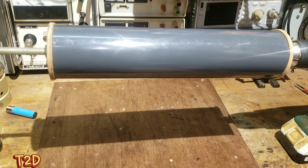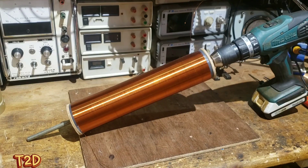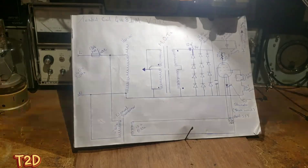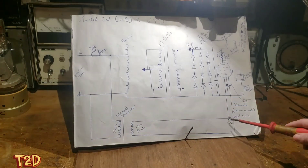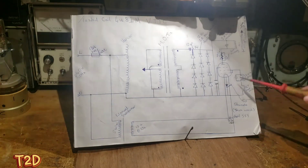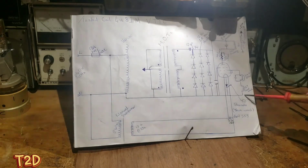You can either wind it by hand or use a simple jig. I'm going to start by securing my wire at one end - you may need an extra pair of hands to help. That's our secondary done - it took the two of us about 15 minutes. We secured it at both ends with a bit of super glue and bicarb. So we've completed our filament transformer, the capacitor across it, the primary, secondary, and the feedback.